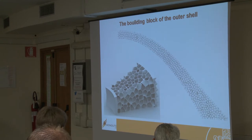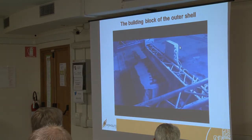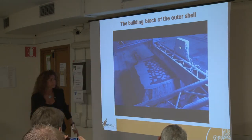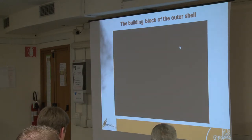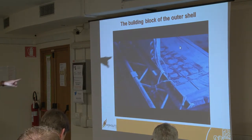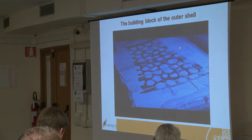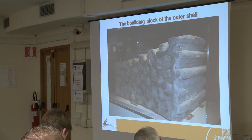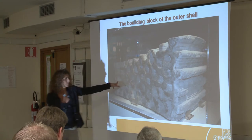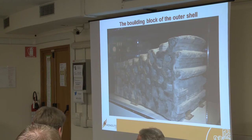This structure also allows combination of different habitation modules. The inner structure of the walls is the so-called closed foam — it forms by bubbles and all the regolith is used also for the walls of the bubbles. This is basically one slice of the block that should be printed. Having an inner inflatable pressurized shell also prevents excessive pressure in the inner part of this sandy wall, so it decouples the forces against the wall. The printing of the big block has been done in terrestrial atmosphere, and this is the result — this is the building block, which has been exposed also at the Turin exhibition for the 150 years of our republic.